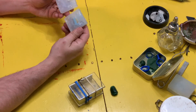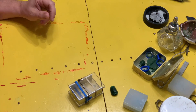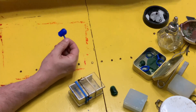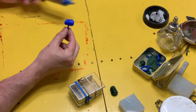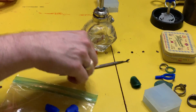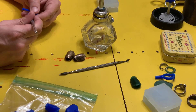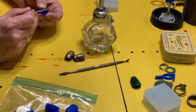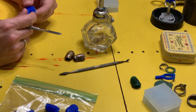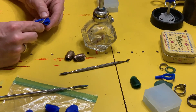Here I'm showing you the mold after I've taken the wax out of it. Then I put it back into the little frame and inject hot wax into it using basically a turkey baster, but an all-steel one. Then I let it cool and take it out. There's usually some cleanup — there may be bubbles or imperfections in the wax, so I can file them off or fill holes with a little bit of melted wax using that small alcohol lamp.